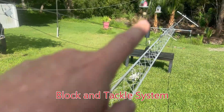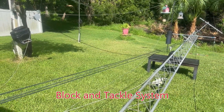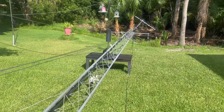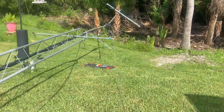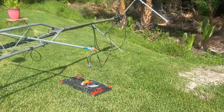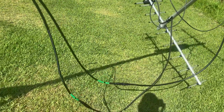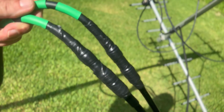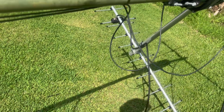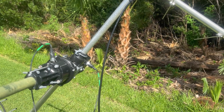From the winch to the first pulley is what gets wound up on the cable; the rest stays within the pulley system. I removed the preamps from the tower, and instead of re-running coax I put bulkhead connectors on the 70-centimeter and two-meter antennas, wrapped in weather stripping. I'll have to keep checking those as the sun beats down. Here's my Yaesu rotor — I did not replace the cross arm today; it's too hot.